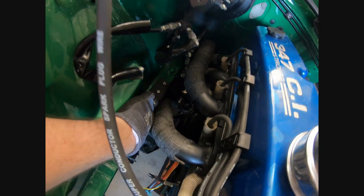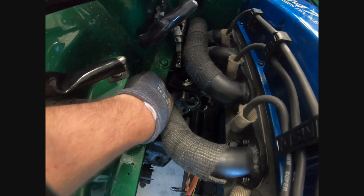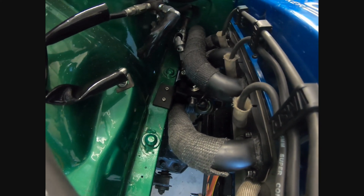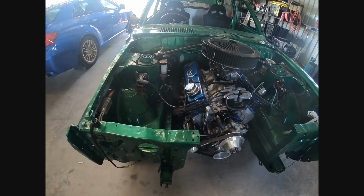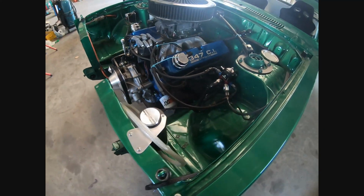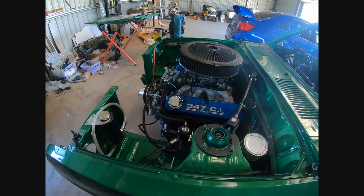Steering idler bracket, maybe. So it's holding this rod end spherical joint that's actually supporting the bottom section of the steering shaft, because I have 3 universal joints in there to get the alignment correct. So I built all this with just a grinder and a MIG welder. I don't have a cut-off saw, I don't have a bandsaw, so I think I did pretty well. I'll obviously upgrade before I take on the other project. I think I need some more gear for the workshop.